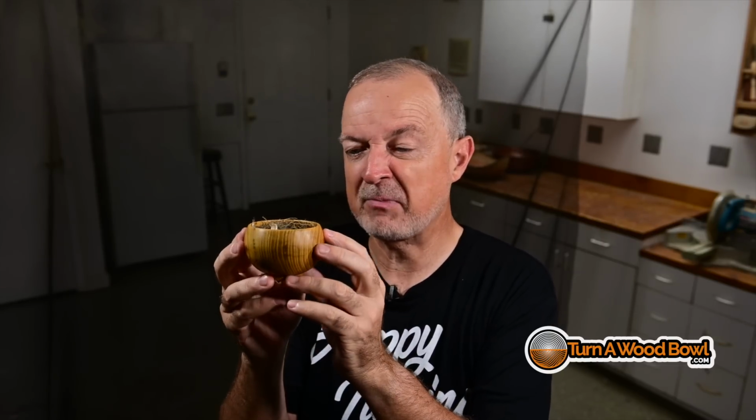Okay, all the bird stuff aside, this is a great little project to use a scrap piece of wood, especially a quarter sawn piece of wood. Now, this one has been laying around a while, so it's relatively dry. I'm not worried about this shrinking at all. This is going to be in good shape. It's not going to change shape hardly at all. That little chunk has been sitting around for many years, so I know that it's cured and dry all the way through, or equalized. So I'll be able to put this on the shelf with great confidence that it's not going to distort.